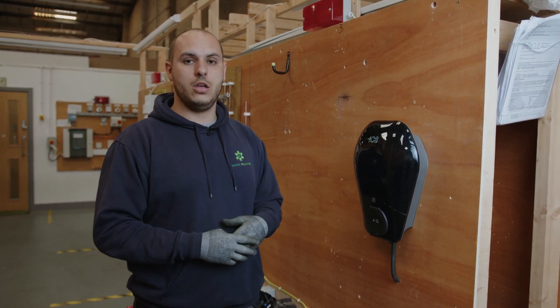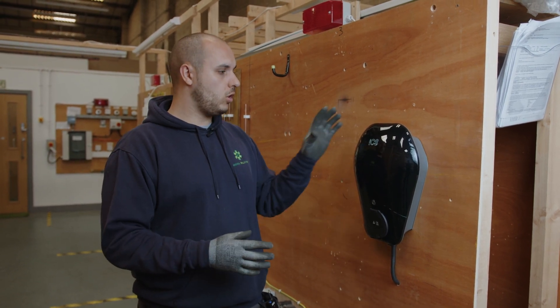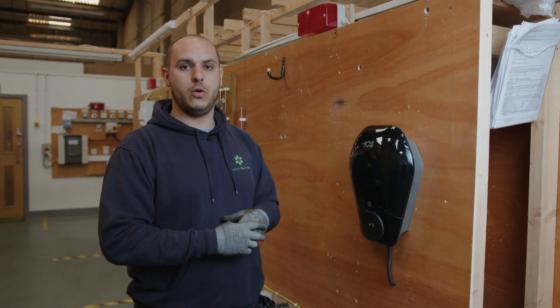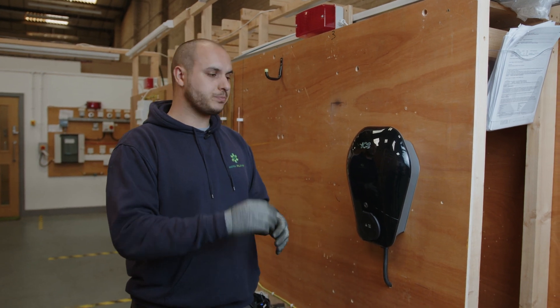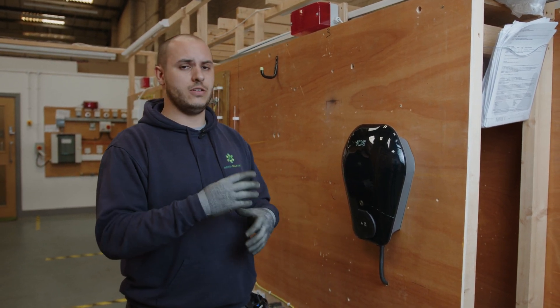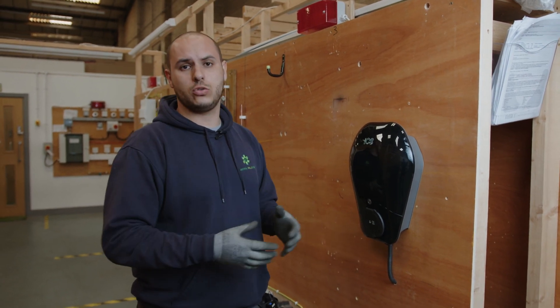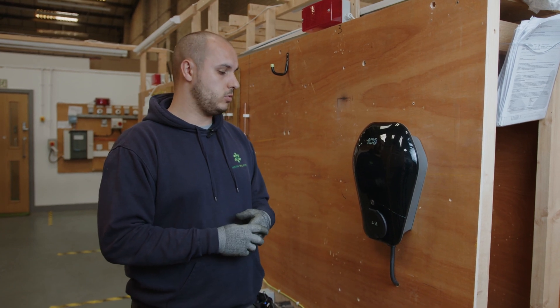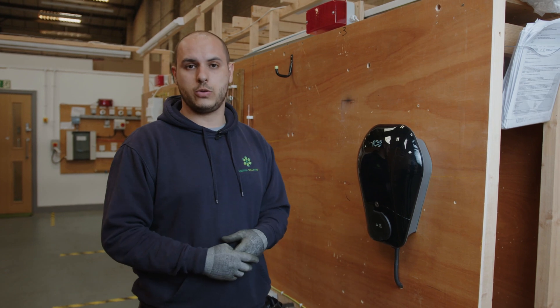We're going to have a closer look at the backplate and see what's going on inside, because a lot of the key components are located in the actual charger unit itself. From an installation point of view, if you're just going to first fix, you can put that in and do all your prep. You can even complete second fix parts, test, and leave the additional cover — which can be purchased separately — to be put on at a later date.